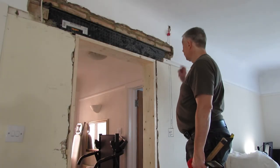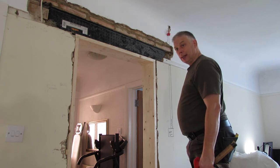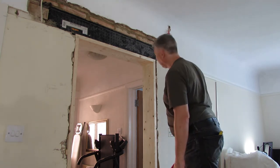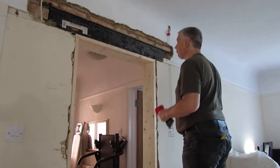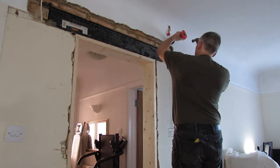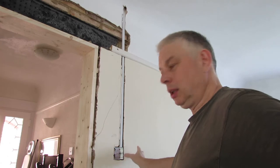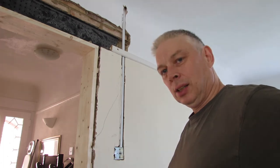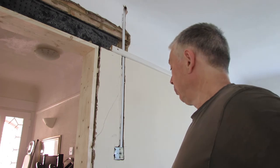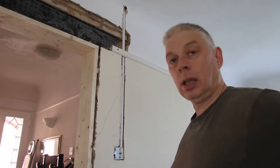So now I've got to get my wires up here to my wall box down here, all chased out in the plaster. Luckily I've only got a 60mm deep wall box and about 20mm deep was the plaster, so if I chop back to the brick everything should be hunky-dory — more mess though. Well, that's the mucky work done for the day. We've chiseled out all the plaster and found out it was only about 40mm deep here rather than 60mm, so I've had to chase back the brickwork ever so slightly. No biggie — the box is in, the channel cut, and the cable management in place.